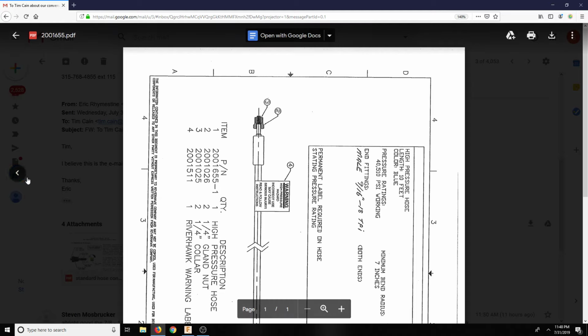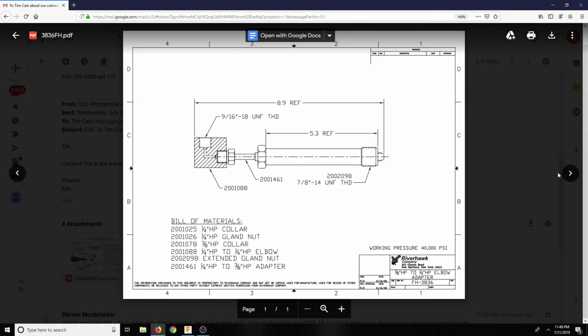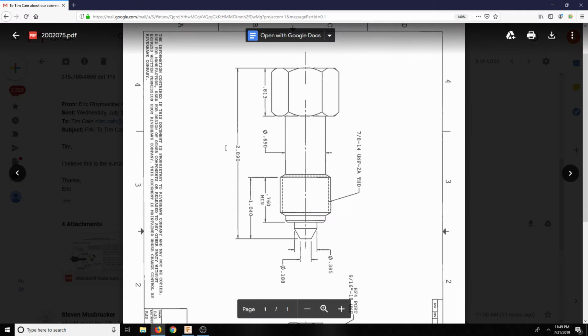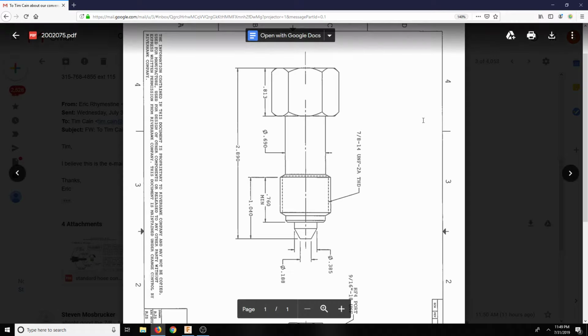And high pressure hazard. Also, as you see here, this is a 40,000 psi rating. I believe this is still the same. Obviously, it's rotated. But I do like this one because it's shorter, 3 inches, which is not that long. It's sticking on top of the head, and the head is already pretty long, especially fitting it on this gantry. But this gantry is extremely stiff, so I'm not too worried about that. Anyways, we'll probably go with this one.